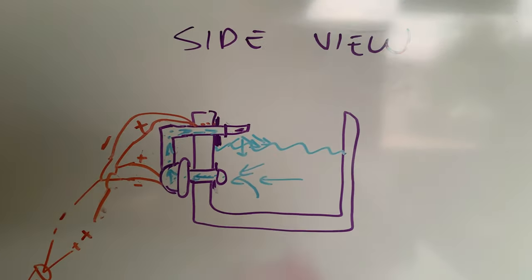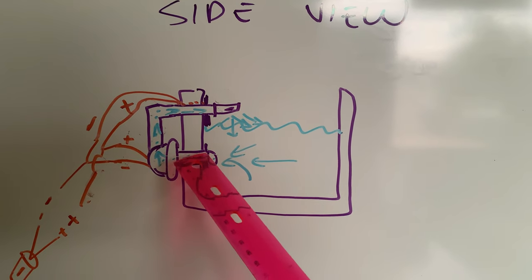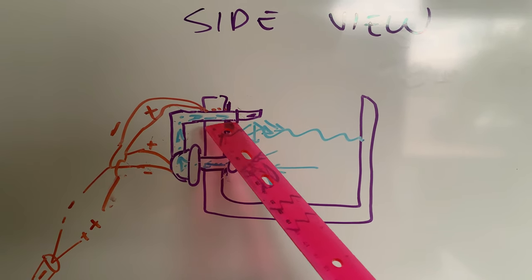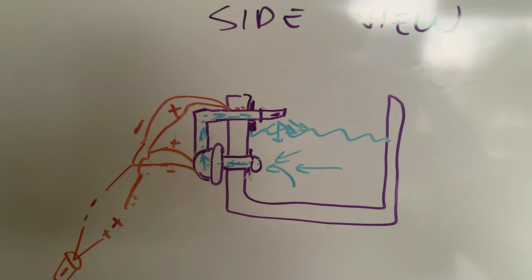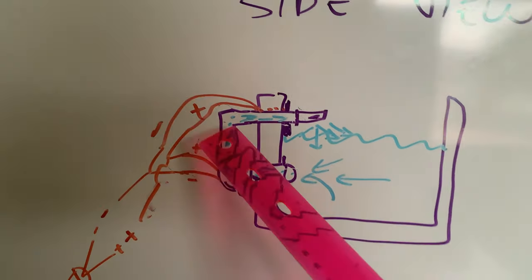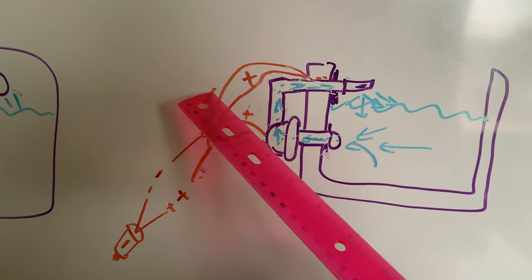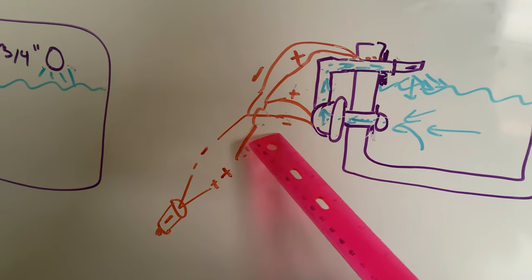For the side view — very simple. Here's your one-inch hole, that's where you're going to put your aerator pump through. You're going to put a gasket so that the water doesn't leak out, and then up at the top again with a gasket. This is where the riser pipe went all the way through, because the aerator nozzle was not able to go all the way across the thickness of the cooler — that's why I had to improvise. Right here is where I have the light; I drilled a small hole there just enough for the wires to get out, so you have your negative and your positive wire from the aerator and the light.